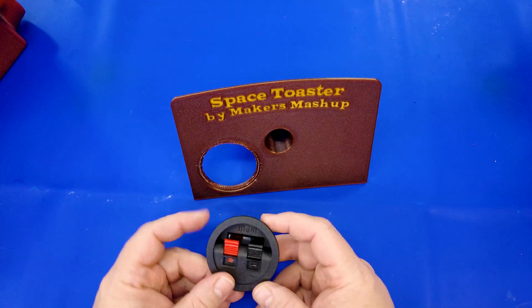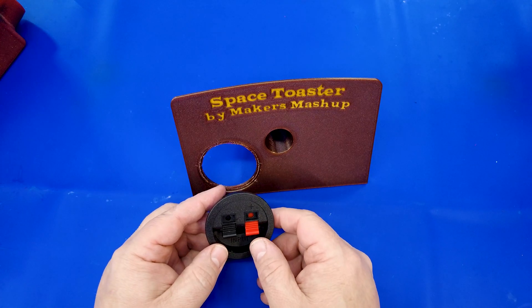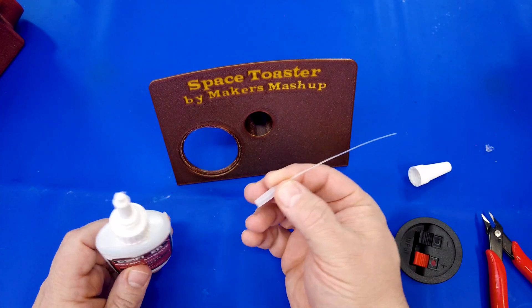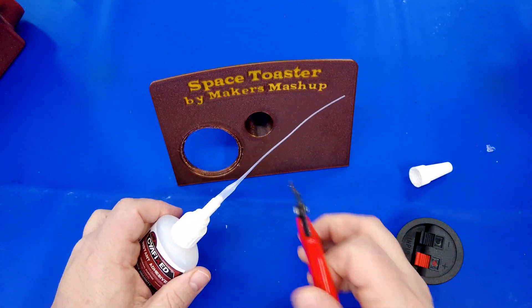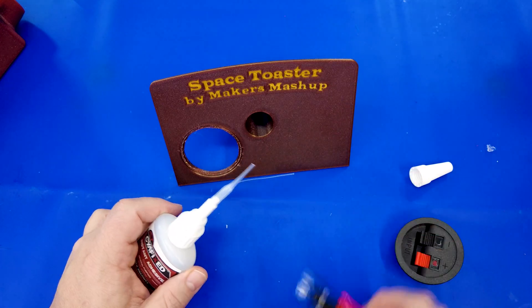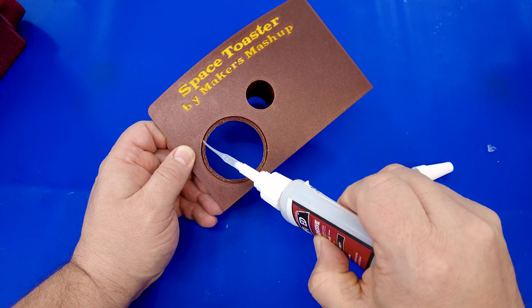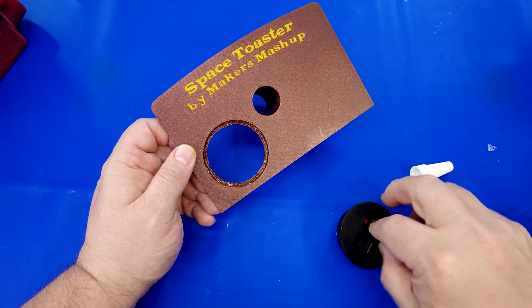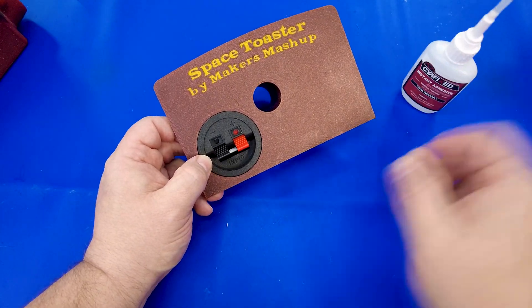We're going to start with the back assembly. I've got push spring terminals so you can easily hook up any speaker wire. I'm super gluing these on using CYA Fixed — I'll have a link in the description. You can attach little tubes that let you feed super glue very precisely, trimming them right about here. Once the glue is in place, just drop the spring terminals in, being careful not to get glue on your fingers. You can clean that up with acetone or nail polish remover.